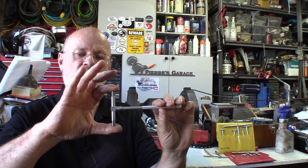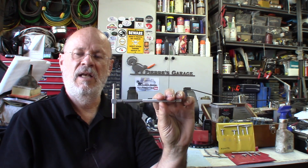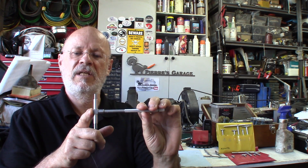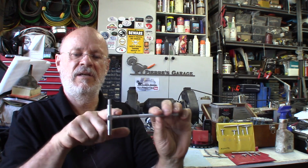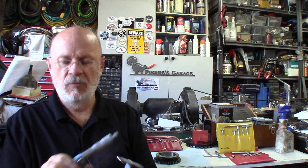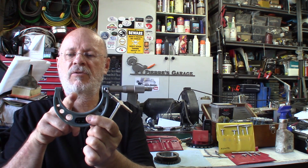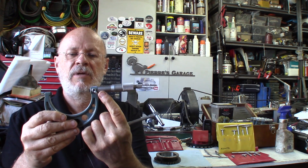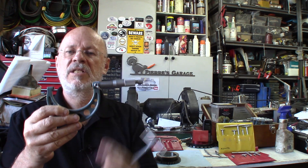The space between those two pins here is unknown until you measure it with something else. So this is not a direct reading tool - it's an indirect reading tool because there's nothing on there that will tell you what it is. So we need to use a micrometer. A micrometer is a direct reading tool because between the two anvils there, you can directly read on the thimble what the distance is.